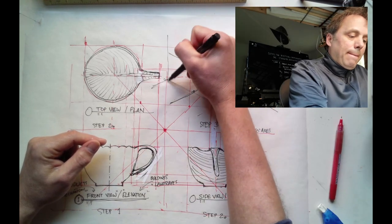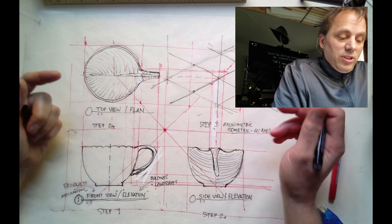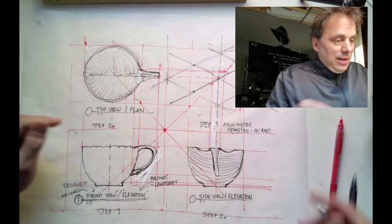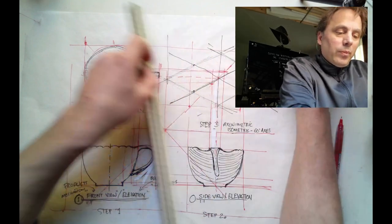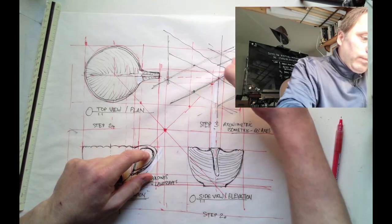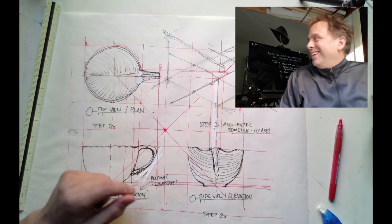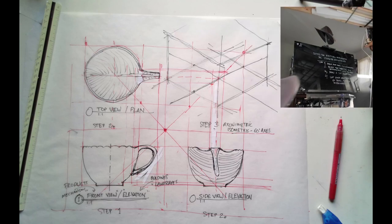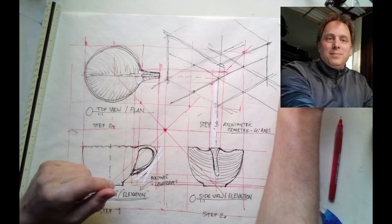If I draw verticals here, those verticals will be the sides of the outer box. Notice it takes up a lot more space on the page than drawing your orthographics. It also takes a lot more time. So we said it was 2 1/4 tall. So if I go up 2 1/4, so this is the total box, and I'm running off the top of the page. And I'm running into my picture on the side. Just a second. Okay. So, there we go. All right.